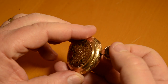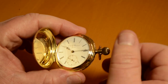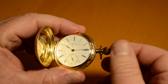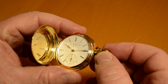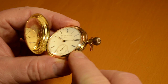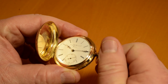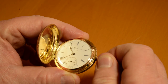You can wear that snap out, which we see quite often. The crown here is for winding and setting. This one does not have a pendant set — it has a small lever set, where a lot of hunter case watches are pendant set. There's a little lever right here, and on some of them it pulls out, but on this one you actually push it up and it comes out slightly. Then when we turn the crown it sets, and when we push it back in it's back in to wind.